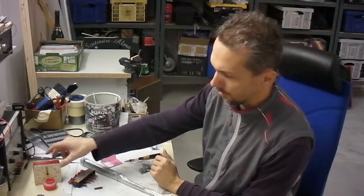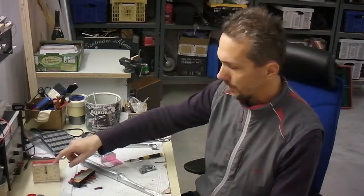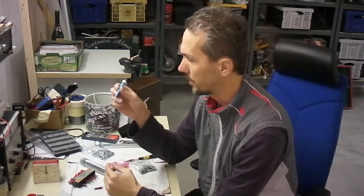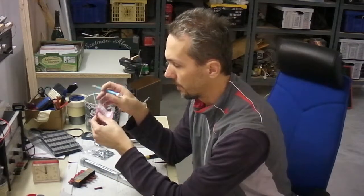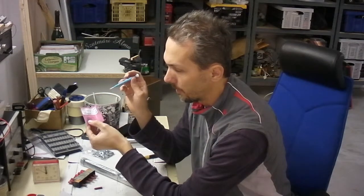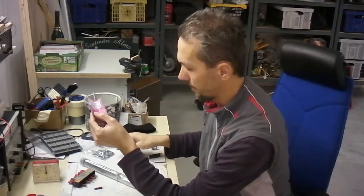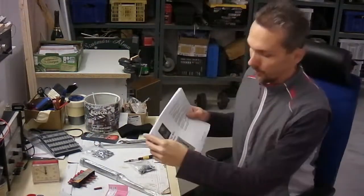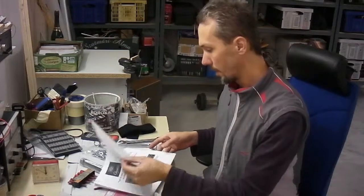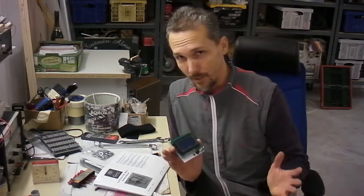I will also set up a clock for you because the playback will be sped up, so you can see here the time it took. I finally found out what this plastic screwdriver is for — after setting up the printer we need to adjust the current of the stepper motor drivers, and as it will be under power, it's a good idea to use a plastic screwdriver instead of a metal one. And last but not least, of course, we need the assembly manual. I will follow the manual, except for some small modifications. So let's get started.